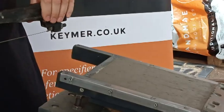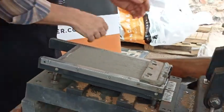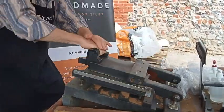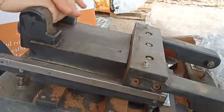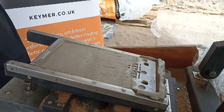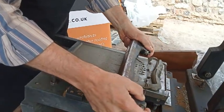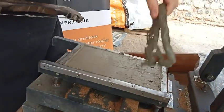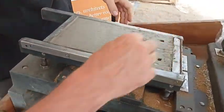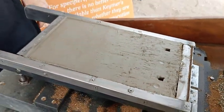Put your bow down again, grab the head in the middle there and then slam it down one-handed — just a wallop. And again. Now take your wire and trim that excess off. What you generally do when you do that is compacting that area. Sometimes if you've got a tile that's got nibs on — a traditional tile that you see nibs on — you've got to put that excess clay in there by slamming it down; you've got to force it into that mould.